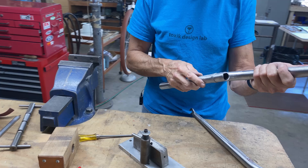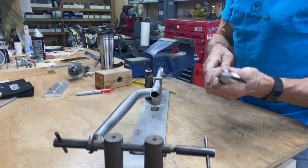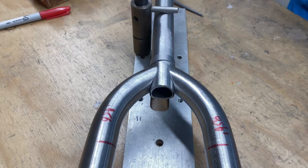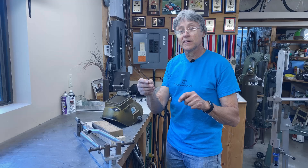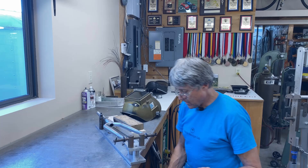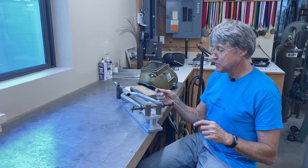I'm just setting the height of the crown race now. I'm looking here and I need enough space in here for the fillet brazing, so just a little more. Make sure that the miter is in the center and not cocked one way or the other. I think I'd like to tack that — just put a couple tacks in there — and then we're going to braze. It's just a mild steel rod. Some people when they weld chrome-moly 4130 want a chrome-moly rod, but I was told a long time ago that a mild steel rod allows a tiny bit of microscopic flex so you tend not to get cracks. I've had really good success with mild steel rod.